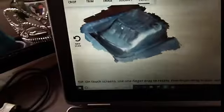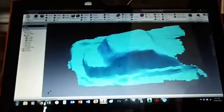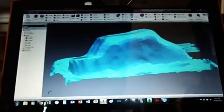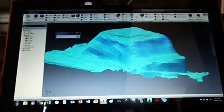You can see where the sway bar was rubbing, it's all dented across here. So we'll just have to remember to put that plane a bit further back on the new piece that we weld, to get a bit more sway bar clearance for our RB S13s. It's definitely something we can work with. Alright, so now I've got it in Inventor. It usually comes in some horrible black colour, but I've changed it to this blue. Turn the mesh on so you can see all the faces that it's tried to generate to make it into 3D. It's not too bad, but we'll see if we can measure anything off it.